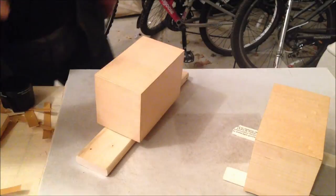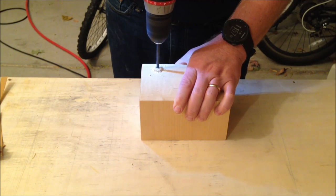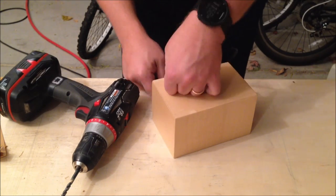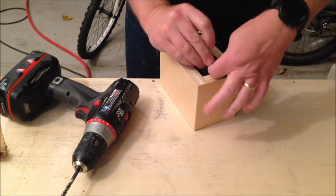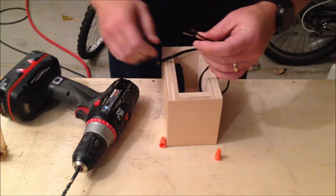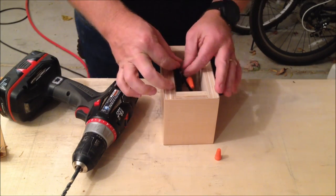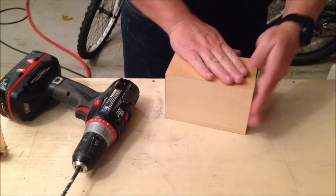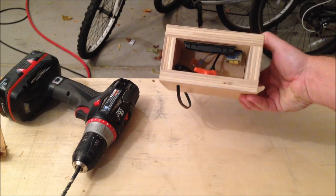Then I hit each box with two coats of polyurethane, sanding with 400 grit in between. I drilled a hole in the back of the box and fed the power cord in through that hole. I tied a knot in the cord so you couldn't pull the wire back out of the box. Then I simply used some wire nuts and connected the power cord to the power wires that were inside the box. Make sure you pull on your wires after you put the wire nut on to confirm they're securely held together. You can see the bottom of the box — the black bar towards the top is the buttons used to set the time, so it's easily accessible.